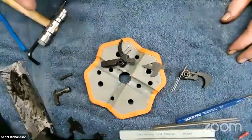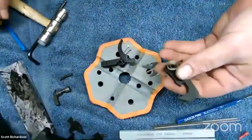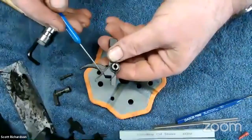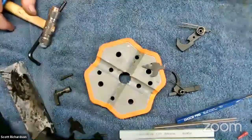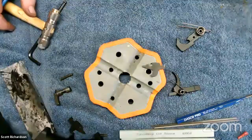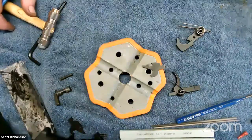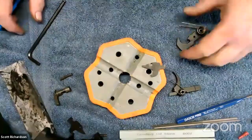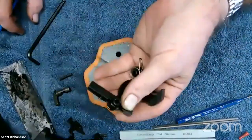People mistake the idea of smoothing or polishing a trigger with lightening the trigger pull — going from say five pounds to three pounds. That's not what this does. It may feel a little lighter because you have less friction, but it'll still break at the same point. The way people lighten triggers on ARs is they cut one of the spring legs off the trigger spring — maybe that much off one side. Even a mil-spec trigger isn't a really tough pull. If you want a super light trigger on a match rifle, buy a Geissele or a drop-in trigger and do it right.